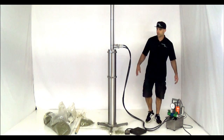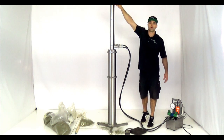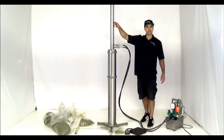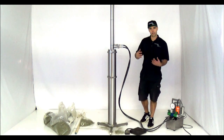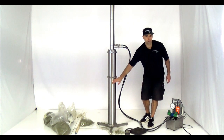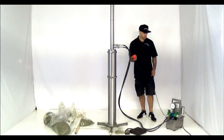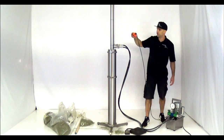So we're going to push this down. We have a line here showing me where 16 inches is, so when the magnetic blue ball at the top comes down we'll know we're halfway — right at the top of the column we're going to extract. I'm going to go a little bit further than that just to create some head space, because this material is really light and fluffy and loose. Over the course of the next half hour or hour it's going to want to push up just a little bit, so I want to get this down about an inch or so. If you were going to extract it immediately, you wouldn't need to do that.